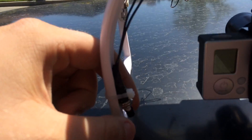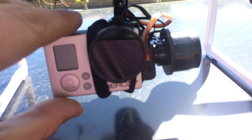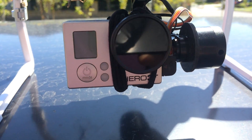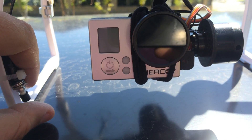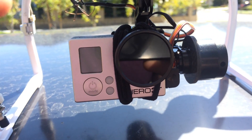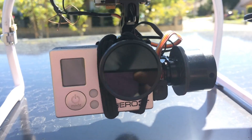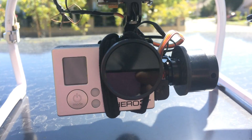The main reason why I did this — it does a couple of things. If I hit it twice, it will let me set the gimbal angles by hand in case it's a little off and I can't get to a computer, so I just need to fix it really quick. But the big reason it suggests getting a button if you have this gimbal is: if I push it once, it turns off the motors. I like to turn off the motors when I do a compass calibration so that while I'm spinning the Phantom around at an extreme angle, the motors aren't working really hard trying to fight those angles.